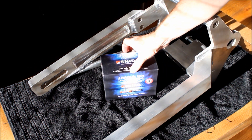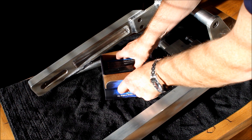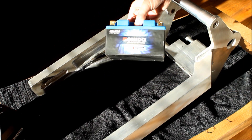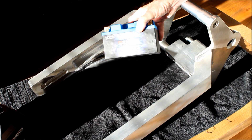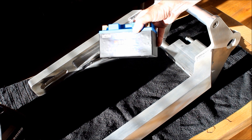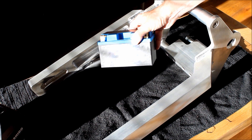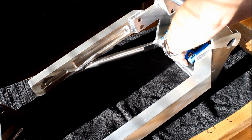I'm going to use this Shido lithium iron battery — very light. I've got something similar on two of my other bikes. This one is a 14S, meaning about 14 amp hours equivalent to a standard battery. That's quite small compared to the 20 amp hour battery I've got on the bike at the moment, but these lithium-ion batteries give something like two or three times the cranking power of a standard lead-acid battery.